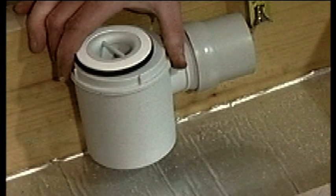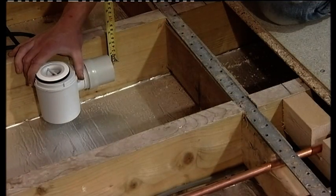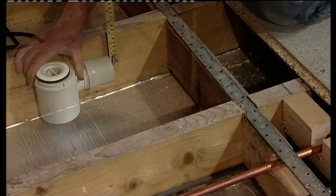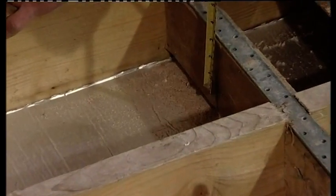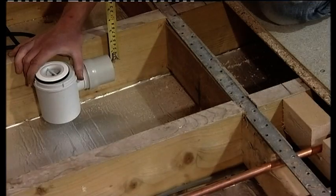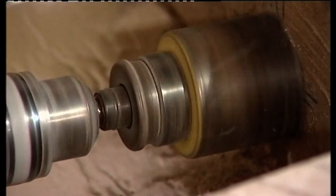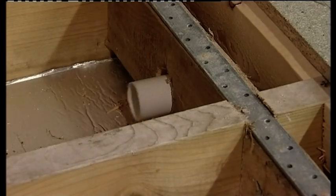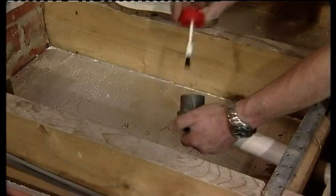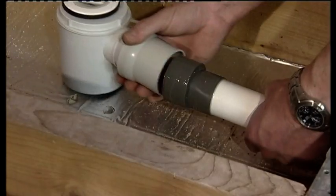The drainage is now ready to be installed. In this installation we are using a horizontal gully; however, alternative drainage options are available. To install the gully correctly, the waste pipe and the trap need to be accurately positioned in order to align with the aperture in the Aqua Deck. Here a hole is drilled through a noggin, and the waste pipe is then pushed through and coated with solvent weld cement. The reducer and the trap are also both coated and connected to form a good seal.